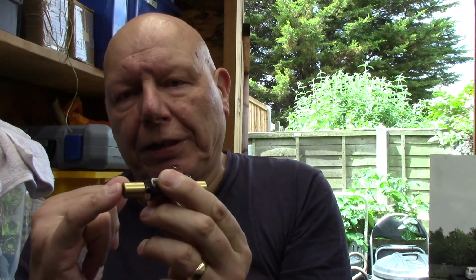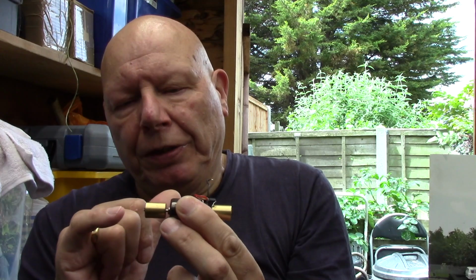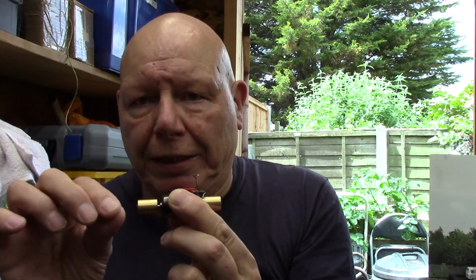The new motor arrived, and where is the motor? This is the old one I've taken out. It's very straightforward to take this little bugger out and put the new one in. You've got your little universal joints that click on, and they're on an extendable bar, so it's very easy to put this in place. You can put it in place and then connect the universal couplings to it afterwards. All right, so quite straightforward.